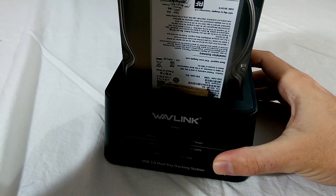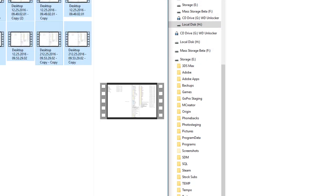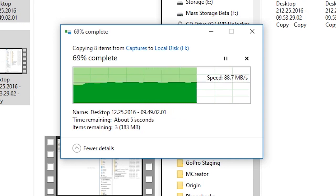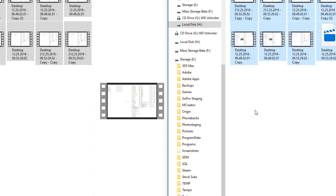Not pretty, but it works. Moving on from my hand modeling, let's see how well this $22 dock actually does. For real-world transfer speeds, while copying 600MB of videos to the 500GB Hitachi from my primary SSD, I got speeds around 90MB per second. While not as high as you might expect, it is still quite reasonable since we are going through a SATA-to-USB interface with a good bit of software overhead, and it still only took a few seconds to copy those files.